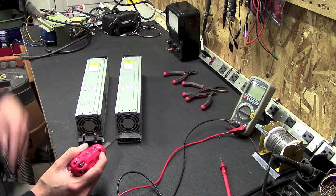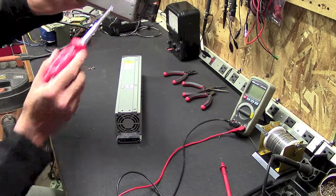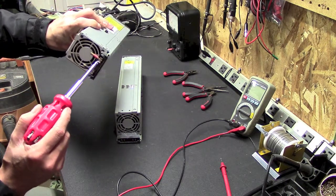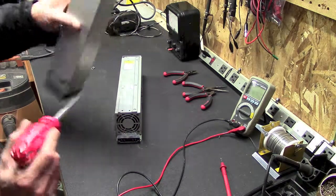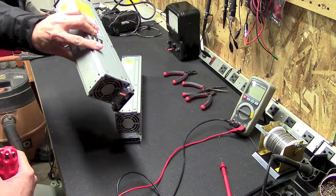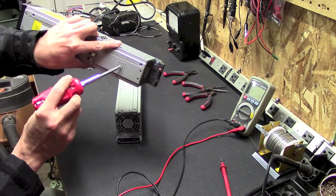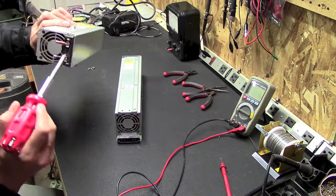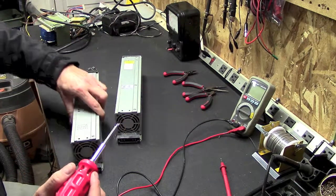So that's my plan. Also, if you're going to use one of these power supplies, you can see I've got a little diagram here, but you have to figure out which of these pins need to be shorted — there are control signal pins to turn it on. If you just plug this in, it's not going to turn on. I was able to find the pin outs online, and that's what my little matrix is here — to tell me I have to short these three pins together. I actually pulled the case off and shorted them inside.